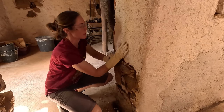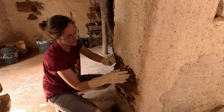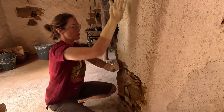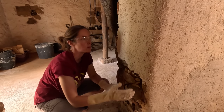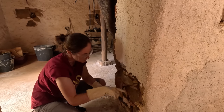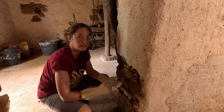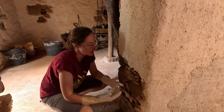I don't know how you guys do it. So you put the chunk of lime into the hole, and then smear it up, and then smear it out, and then you can smear the wall up. Yeah. And then it makes it stick on a bit better, and you get it more consistent thickness. That's the tricky bit, because it's so lumpy bumpy. Trying to make it smooth for when you come and do the next layer makes it a bit easier. It definitely does. It took me a little while to get the right technique, but it's good.